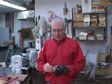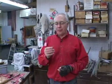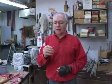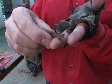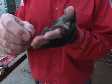Let's start with a new subject: sharpening the little three-sixteenths cutters that we use on boring bars and in the hollowing systems. You could leave it in the boring bar and hold the whole boring bar up on the tool rest, but I usually just take the cutter right out of the swivel assembly and take it over to the grinder.